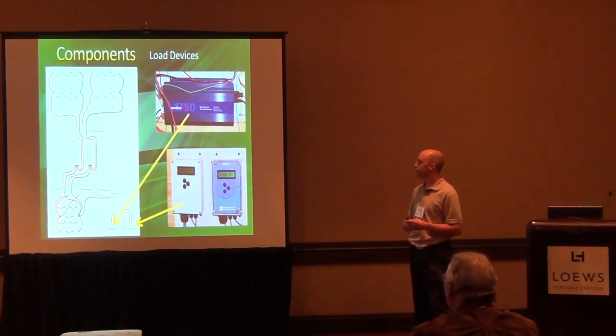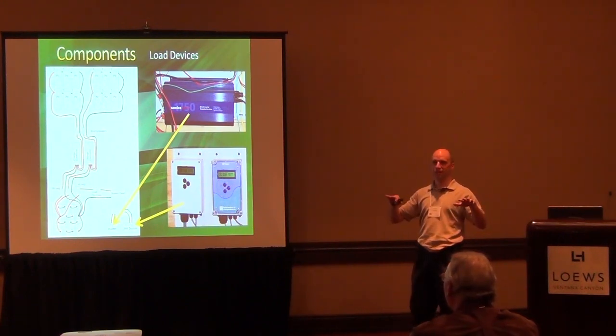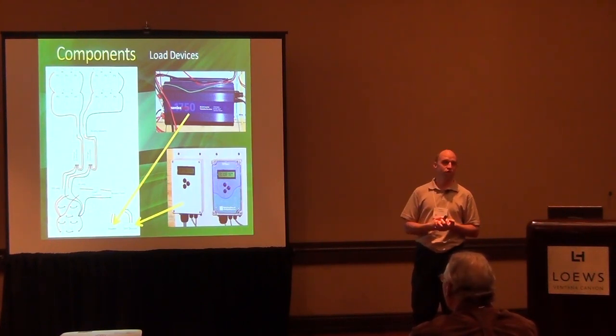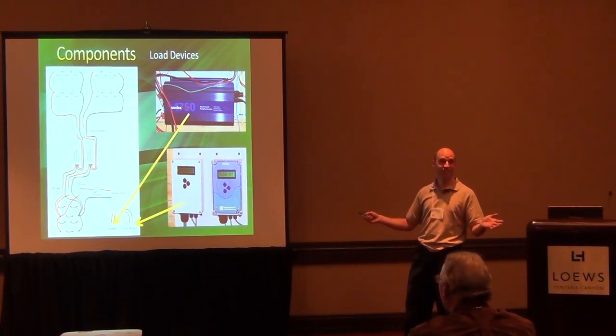The next is your load. I have an inverter running on this. You have to be very careful with the inverters that you purchase because they sell them as a 12 or 24 volt inverter. That's great if you just plug it into your car battery, but on a 24 volt system, if the charge controllers are doing an equalization on your batteries — which is basically overcharging your batteries to help equalize them and make them work better — now you're pumping 30 volts into your system. You have to make sure the equipment plugged in can also run at 30 volts. A lot of the cheaper inverters, if you look at their specs, will say they can run 24 volts but maximum voltage of 27 volts. What happens after 27 volts? Either your inverter burns out or it shuts itself off. You may plug your system in, get it up and running, think it's working fine, walk away, it goes into equalization mode, and either your inverter dies or your fish are going to die because it shuts itself off.